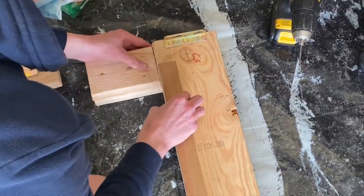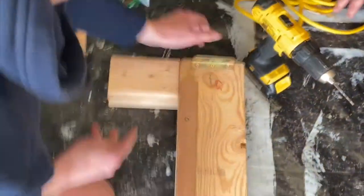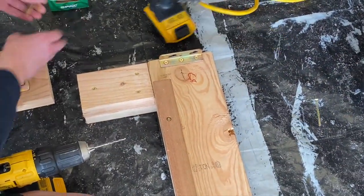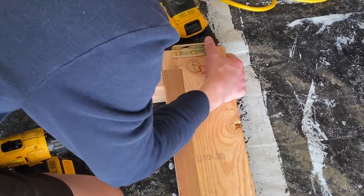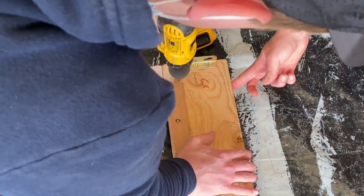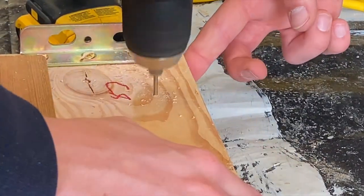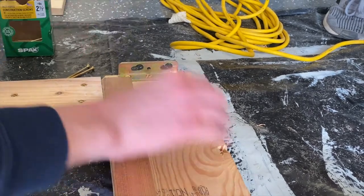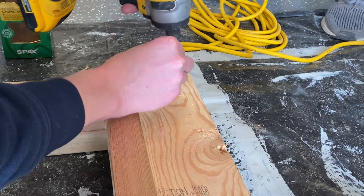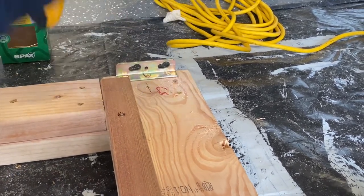Raymond is going to put some wood glue on the bed frame and on the foot, then place the foot onto the bed. He'll drill three to four holes — actually two to three is fine here because you don't have a lot of space. Using the impact drill, he's going to drive the screws in. Do this on both of the long ends to put all four feet on.